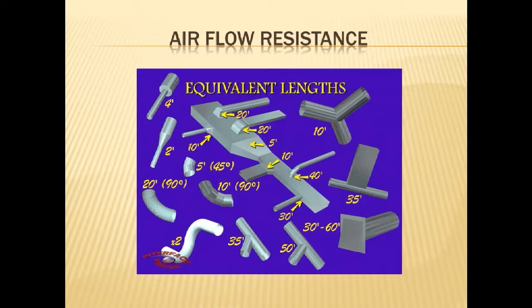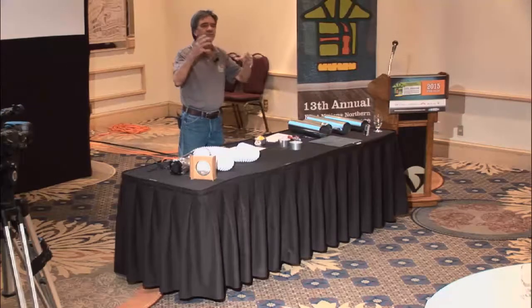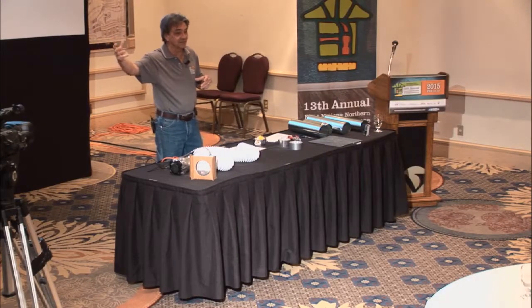Back, Canada Mortgage and Housing Corporation did research, I think it was back in 1980-something, where they went out in Ottawa, and they went out to a whole bunch of houses, and they measured the real airflow that was coming out of an ordinary bathroom fan that was installed. And they found it went everywhere from the value that the fan was rated at to 0. Okay? And it was almost half of them.